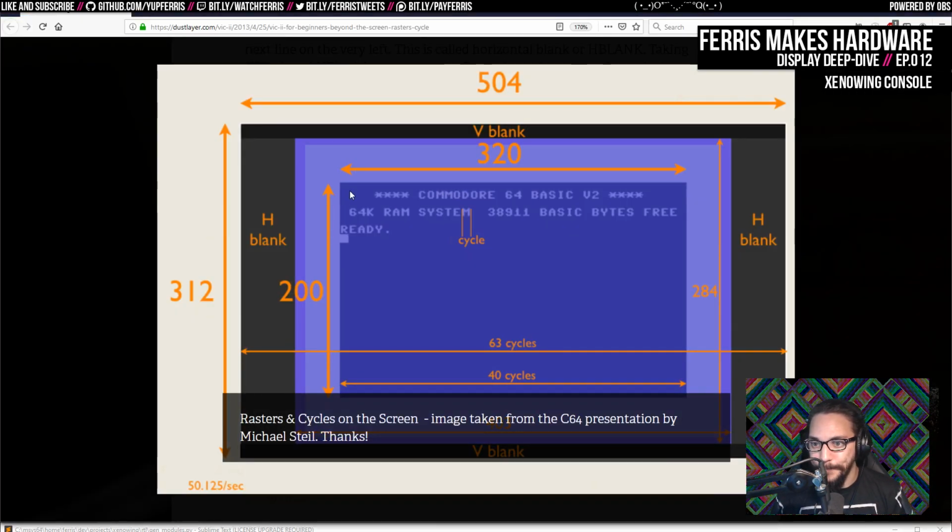And this is very similar. To display characters like this, you need the index of the characters, which we call the character data, and you need the pixel data of the characters for that given line, which we call graphics data. The way the bus on the C64 works is that on the rising edge, the CPU uses the bus, and on the falling edge, the VIC uses the bus. So it actually gets the pixel data for these given characters a cycle or two before they're actually used. You need to do it a couple of cycles before to make the scrolling a little simpler, but essentially it's loading on the falling edges there. It loads all the G accesses, as we call those, where it loads all that data.